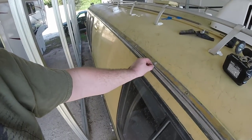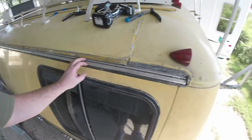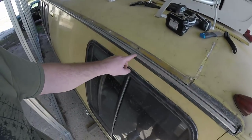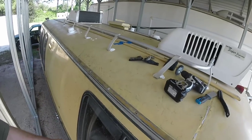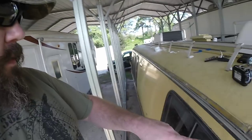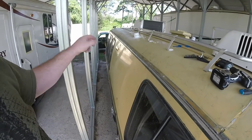Let's finish this up. We got some stuff in here to get out and get it all down, then start working on getting the screws out. Then we get to clean the top rail. Once that's clean, I'll get it taped on here, mark each hole, and drill and tap it. I could just measure, but I don't want any room for mistakes — I'll tape it up, pop a drill, make a little mark with a drill bit, take it off, drill and tap, and everything will be perfect.